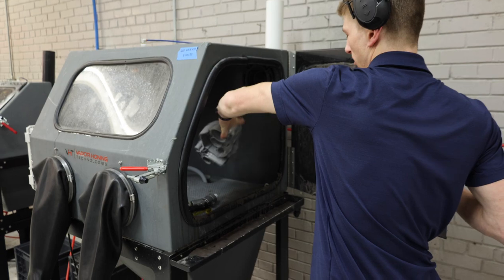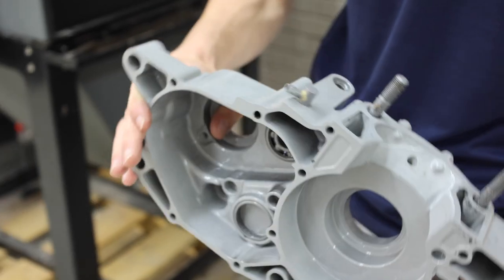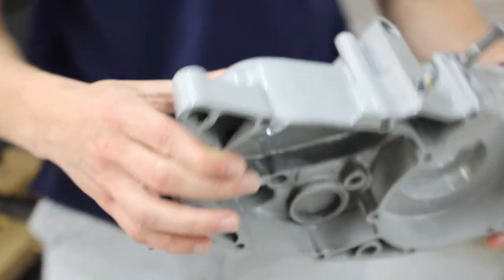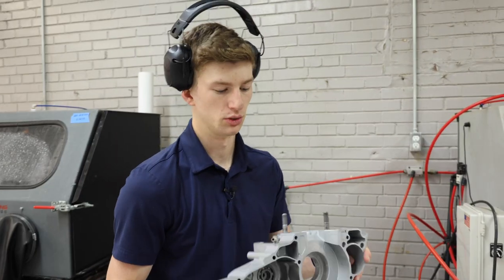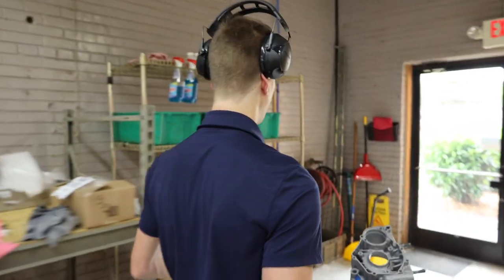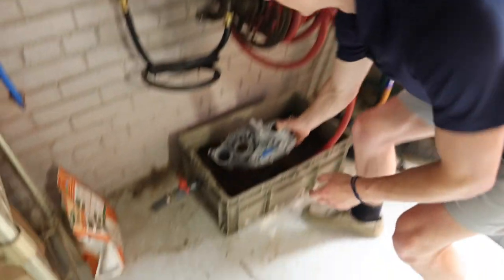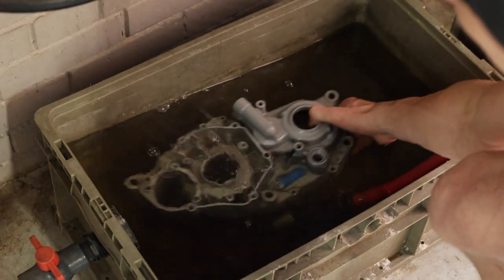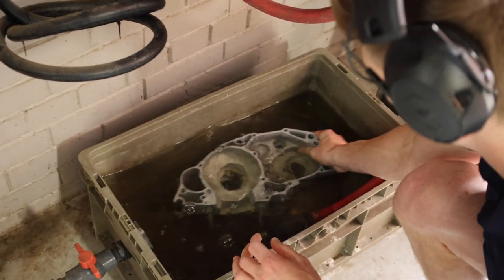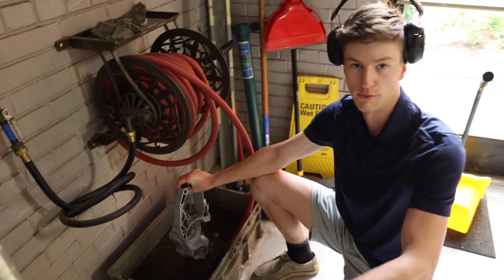This part is by no means perfect, but you can definitely tell the difference from where it is now versus where we started. We're back to bare metal in most places. I'm going to show you how to use a dip tank to get some of the remaining abrasive off. All a dip tank is is just a bucket of water — you take your part, place it in, and allow the abrasive to float up. You can actually see it running off. Using the internal rinse inside your cabinet is a great way to knock off the abrasive stuck on the part before pulling it out.